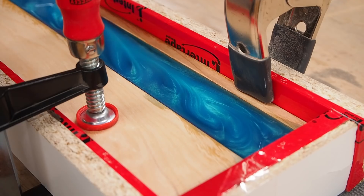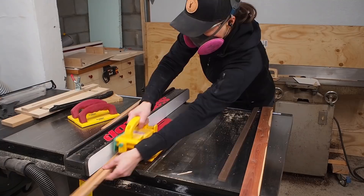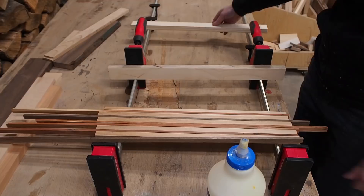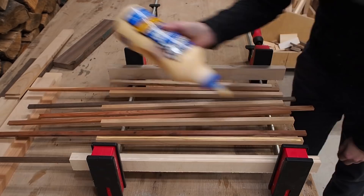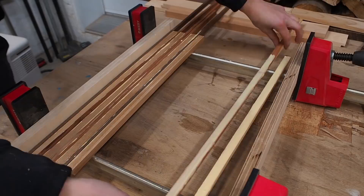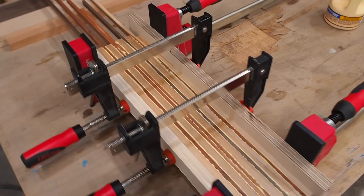If you're not a fan of epoxy, then the next one's for you — this one's going to be all wood. I'm setting my table saw fence to half an inch and cutting all the strips from the various wood species I want to use, since the idea is to glue up a blank that'll be half an inch thick. Once all my strips are cut and laid out, I noticed a strip of walnut that's a little wider than I'd like, so I'm going to rip that down into thinner strips. This is where my gripper with a thin one-eighth-inch leg really comes in handy. I've laid out my clamps and set a caul on each end. I flipped all of the pieces onto their sides and added enough glue to fully cover each strip with the help of a glue brush. I applied just enough clamping pressure to get a little squeeze out, but not too much as to force the thin strips out of alignment — go gentle here. I added a couple more clamps and let it dry overnight.